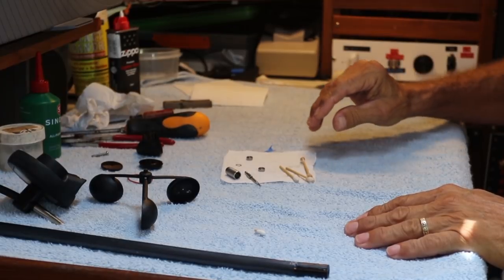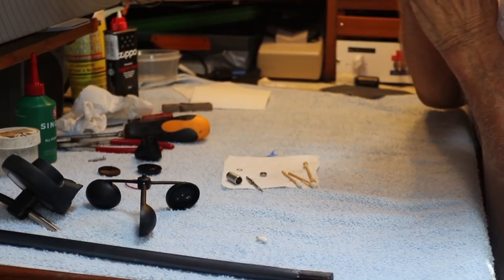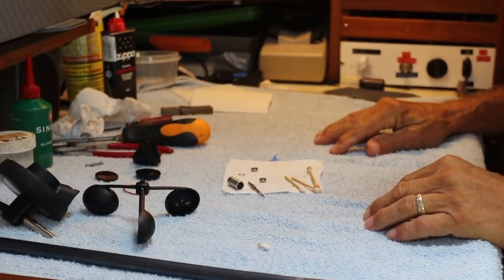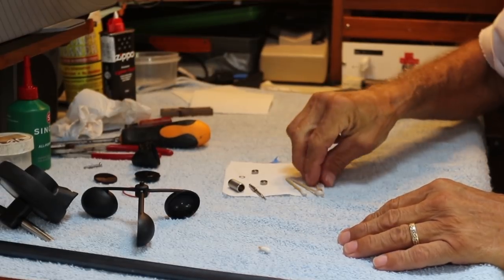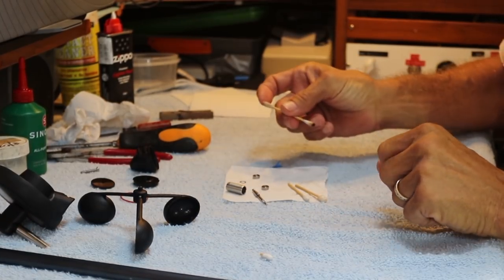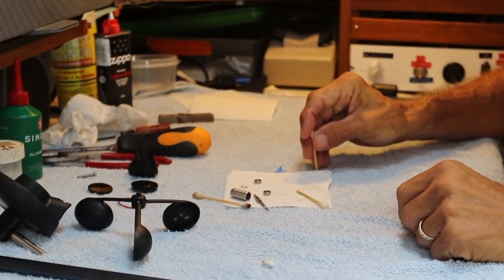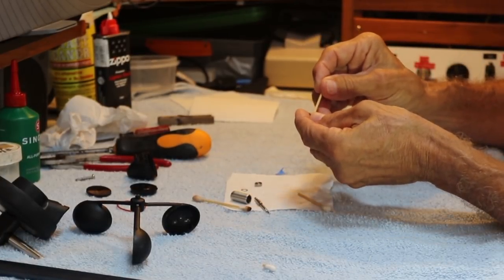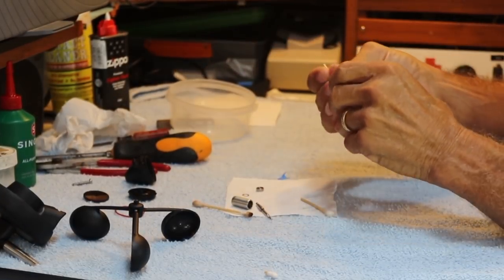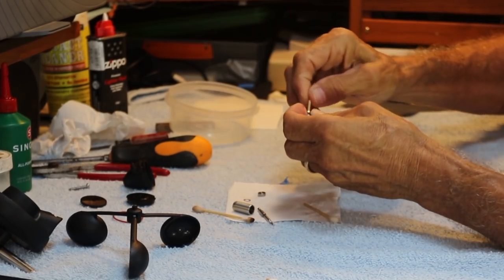It's been about 45 minutes. I've washed everything out and gave everything some compressed gas to try to get all the moisture out. Let it sit for a long time so it can dry out and evaporate, and now I'm ready to put it back together. You can see some of the dirt that came out of inside of this housing and from around the bearings themselves. If you do have bearings that are very stiff — maybe frozen up — you can take the Q-tip, put it down the center of the shaft, and start twirling it around. Put it in your solution of cleaner, twirl it around, wash it out, put more oil in, and go through that process a number of times and it'll generally free right up.